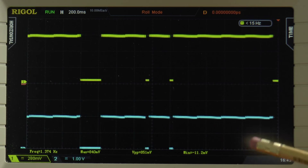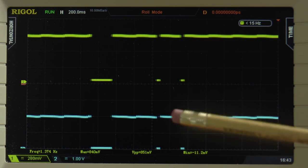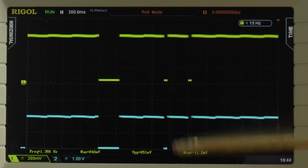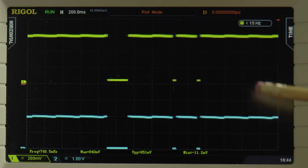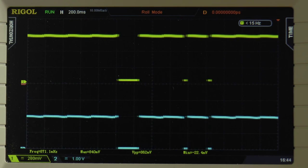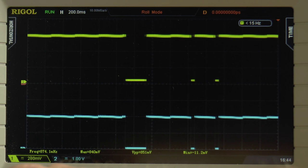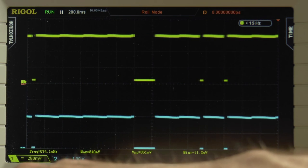If you'll notice, we're on the square wave waveform right now, and you'll notice that the clicks and pops correspond exactly to these three areas where the voltage drops to zero. Dot, dot, dot, dot. It's happening at each of those edges. If we flip to one of the other waveforms, you'll notice it starts happening more because there's more of those sharp rises or falls of voltage.